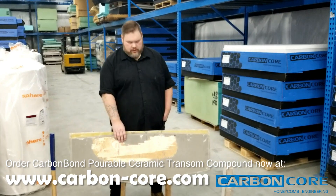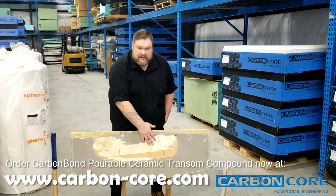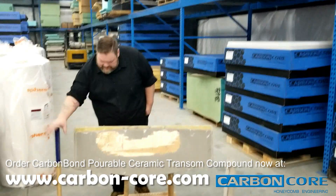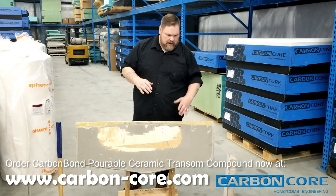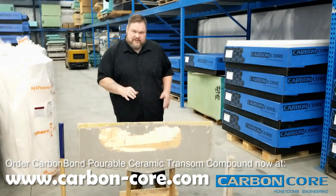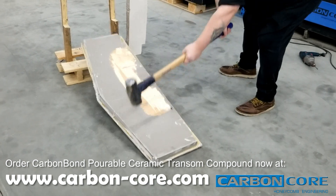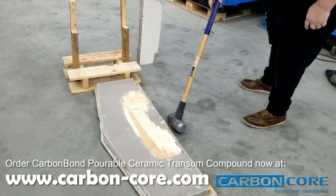It's been 24 hours since we did the pour. We went ahead and removed the facing — this was the fiberglass panel we just took off — and as you can see, it was hard to get off the plywood because it bonded so well. If any bits of plywood are left in your old transom, they'll be right there. Now we're going to hit it with a sledgehammer to show you how strong it is. It cures within two hours for drilling; 24 hours later it's ready to be on the water, and 30 days after that it's fully and completely cured.